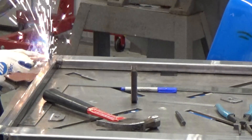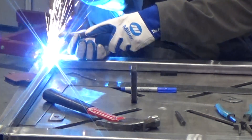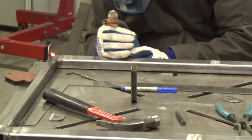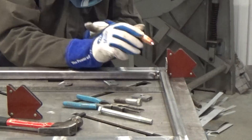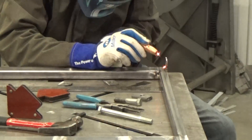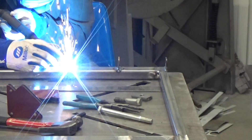I'm just spot stitching the outside and then I'll continuously weld the inside. I've got my Multimatic auto set for eighth inch, but I did fine tune the adjustment down to 16.8 volts and 289 inches per minute of wire feed speed. One thing I like about the Multimatic is you can still fine tune it even in the auto range. Then from the front of each side, weld the tab on the end, then a second tab five and a half inches out — outside dimensions — and then a third tab five and a half inches from that one, outside to outside dimensions.